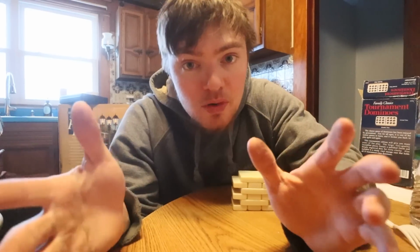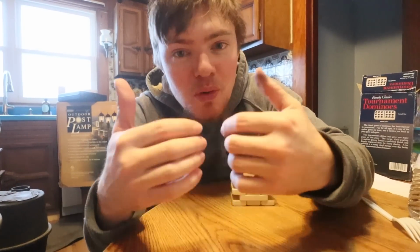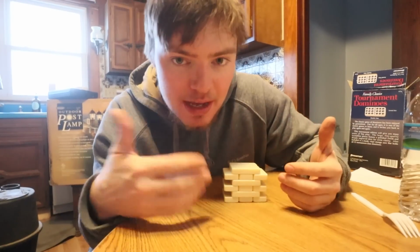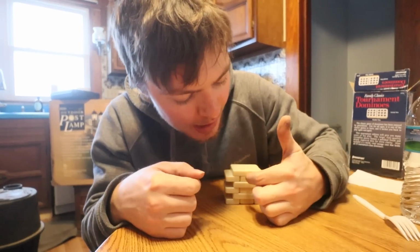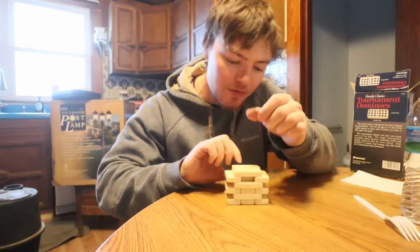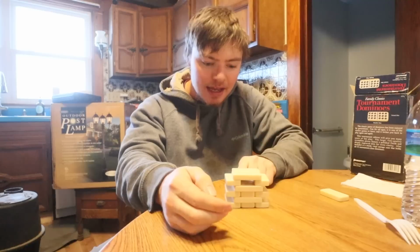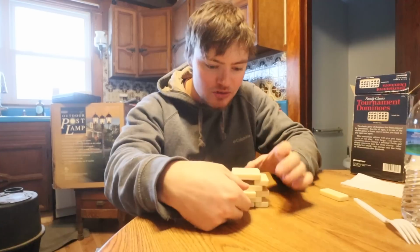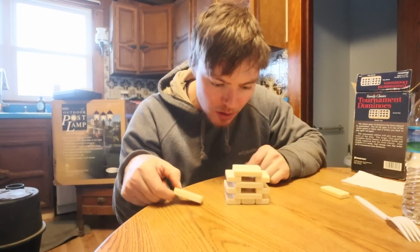Yeah. Now, when it comes to moving walls, we cannot just move any wall we want to. At least we can't move it without rebuilding something to hold it up. So this would be a prime example. Think of Jenga. This is my Jenga, but it's made with dominoes. If I knock out one of these center blocks, it does nothing to the tower. It will not fall over as long as I don't hit the things above it, but it's still standing. I can just keep pushing them out, and it's not affecting the structural integrity of the structure whatsoever. This would be a non-load bearing wall.